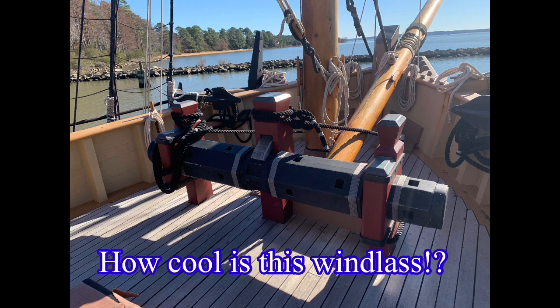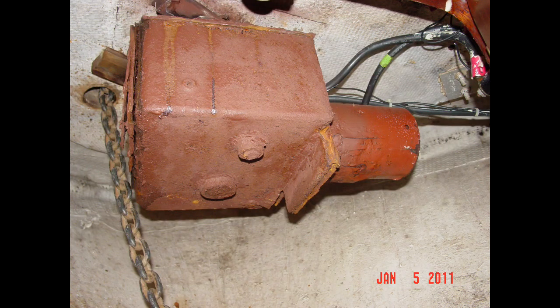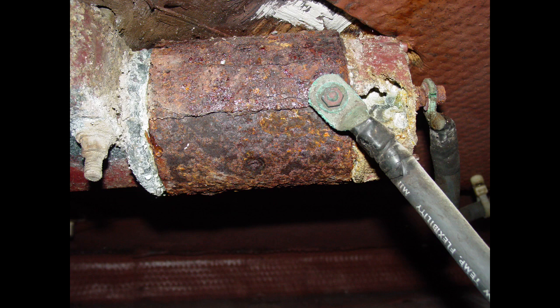Finally, don't forget the windlass. If you have an anchor windlass, it should be viewed as an important part of your ground tackle system. Show your windlass a little love by inspecting it for any issues. Start by checking for corrosion or physical damage. Inspect mounting hardware for looseness, movement, corrosion, and leaks into the vessel interior. Leaks are often caused by a broken bedding seal, which is typically the result of a windlass being overstressed. Inspect electrical connections for corrosion or charring as a result of arcing. Disassemble and clean corroded connections after securing power, using a wire brush and electrical cleaner — vinegar works in a pinch. Terminals and post connections should be clean and tight. Coating them with dielectric grease and installing insulating rubber boots will protect against corrosion and accidental shorting. For units with the motor and gearbox located below decks, check the casing regularly for rust, corrosion, and any such issues. Most are constructed of painted steel and will readily corrode in the damp environment of the anchor locker.